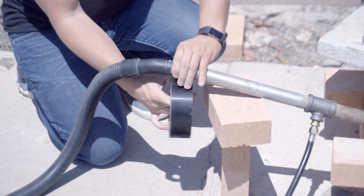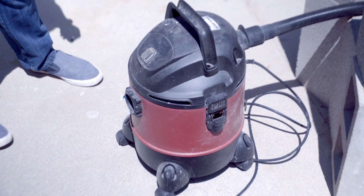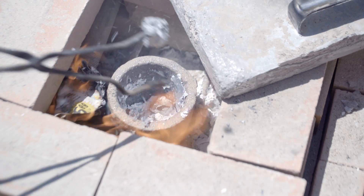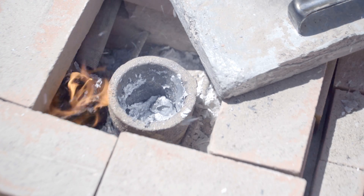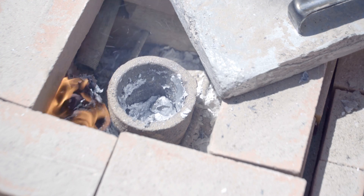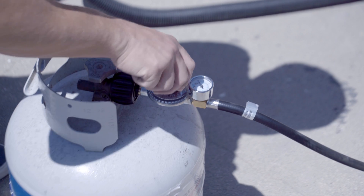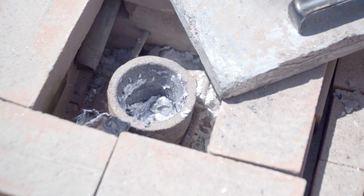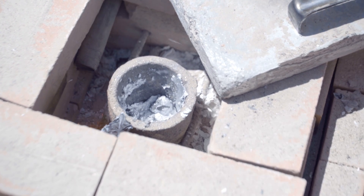The safest way to get the furnace started is to turn on the blower first before turning on the gas. Also have a fire started in the furnace before turning on the gas — that way you don't have to get close to the propane jet when it comes on. Turn on the propane knob then the regulator knob and you should get a propane jet. From here, adjust the regulator knob until you get a good flame vortex going in the furnace. And then you're ready to smelt.